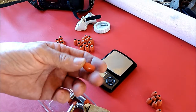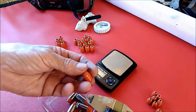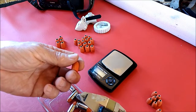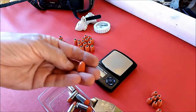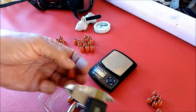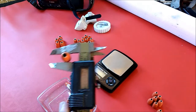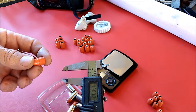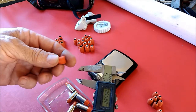The recipe for doing that says to heat them in an oven at 400 degrees for 15 to 20 minutes. I only do it for about 10 minutes, then take them back out and re-powder coat them. That gives them an extra thick coat. By doing that, it gave me a super smooth, super pristine finish on these. Then I resized them again. For example, that registers at 0.453. My sizing die says 0.452, but for whatever reason it's sizing them to 0.453 in diameter.